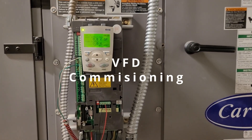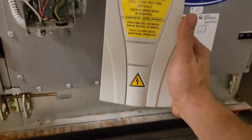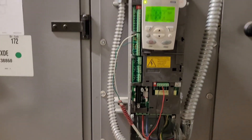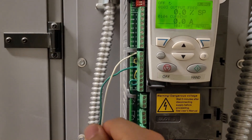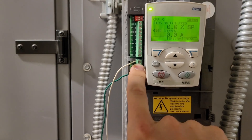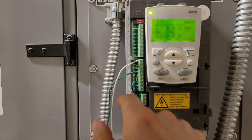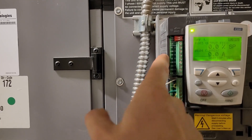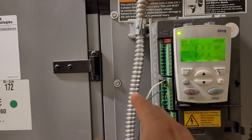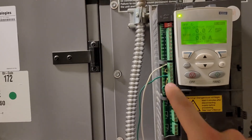We just had an issue with an ABB drive. ABB drives are typically super user-friendly. What you normally find is your start/stop command on DI1 — it's just a dry contact, so you have the top terminals with 24V DC going out to a dry contact relay for start/stop and coming back on DI1. Then you'll have another two wires landed on AI1 or AI2, which is your analog input for your speed command. Your safeties can be wired into the other digital inputs — those are run-enabled terminals.